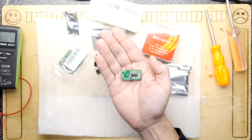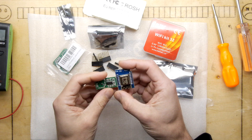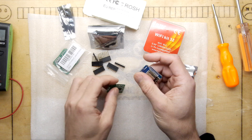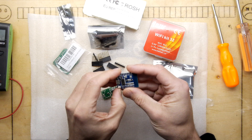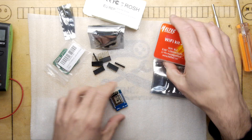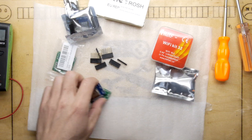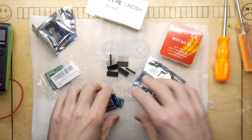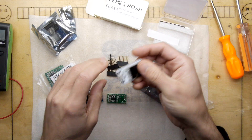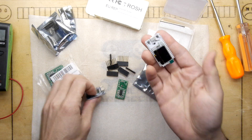So between all of those components, we should be able to knock something pretty cool together — probably using the microwave sensor plus the ESP32 or ESP8266 to give us a wireless room occupancy sensor. We could poll it or use any of the IoT protocols to keep a chart updated of when the last detection was. Between everything, we have three Arduino units and five of these radar boards, so we could build a little sensor network. Stay tuned for that in a future video.